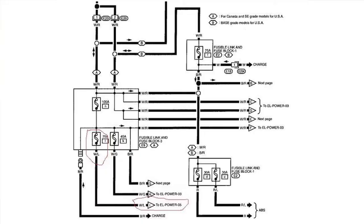The fuse is found in the back of the amp, and that's the diagram that you see here. We have it displayed so that it's really easy for you to find. Once you've located the fuse, you turn it to the left, and there's a little ejection spring in there, and you pull the fuse out, and you look at the size that you have, and any Radio Shack or electronic parts store can supply you the fuse that you need.